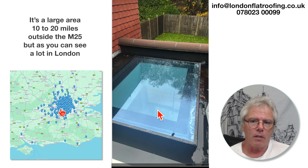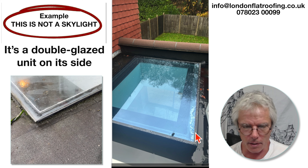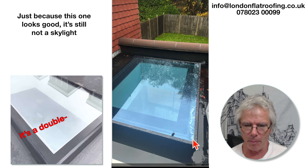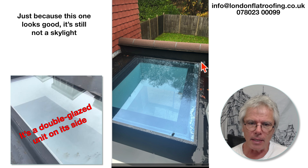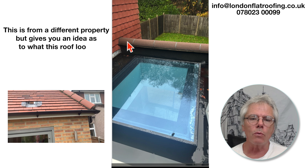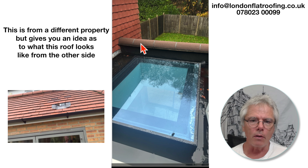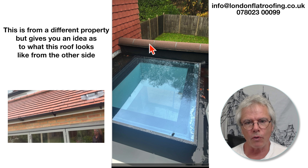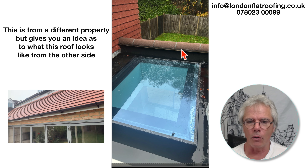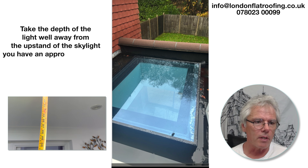This picture tells me lots of things. First of all, there's a nice skylight — at least this is a proper skylight. I see so many skylights which are not proper skylights these days; I've got a video coming out about that. I can see that it's an EPDM roof, all looks quite new. It's a rear extension and it's also got a hip running across here, so this will be like a false front — if you're in the garden looking back, there's probably several layers of tiles there to make it look nice.